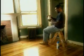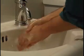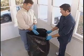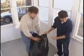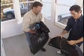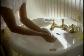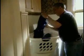After you've cleaned up the work area, you'll need to clean yourself up so that you don't spread any lead dust to the rest of your home, your vehicle, or your neighborhood. Before you leave the work area, remove all of your protective clothing, such as disposable coveralls and shoe covers. Put these items in a heavy-duty plastic bag and seal the bag with duct tape. As soon as you leave the work area, wash your hands and face. When you have finished working for the day, remember that lead dust may be on your clothes and your body. Remove your work clothes and wash them separately from the rest of your laundry. Then shower and wash your hair as soon as possible.